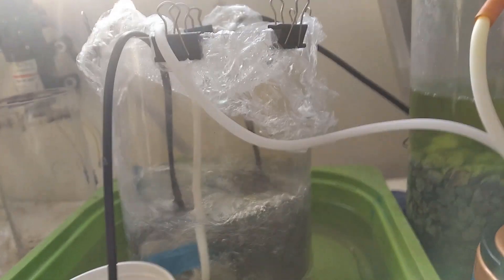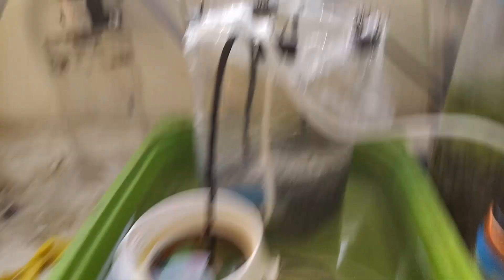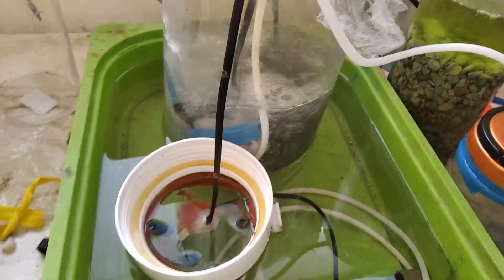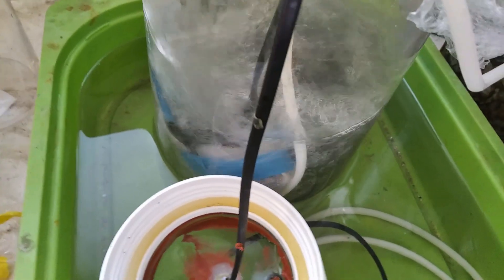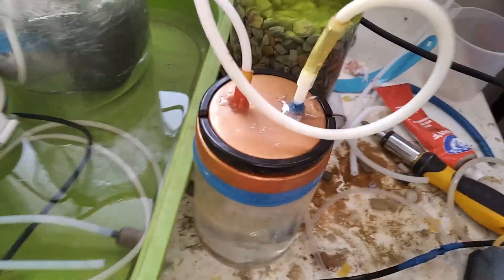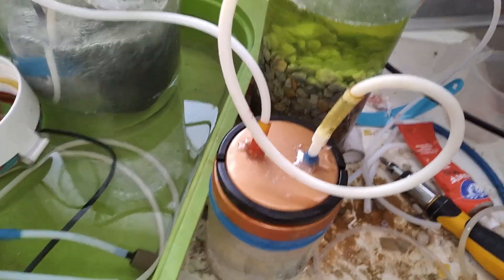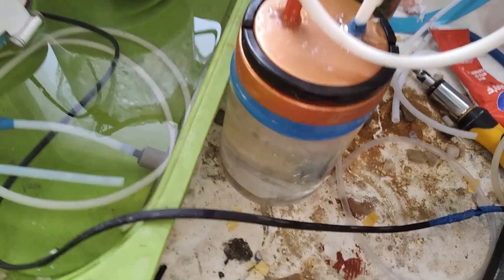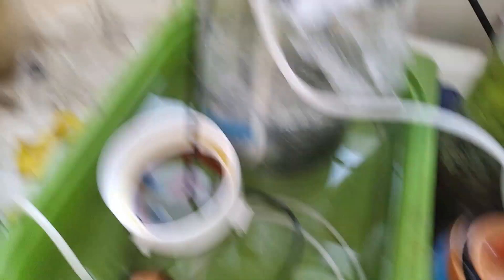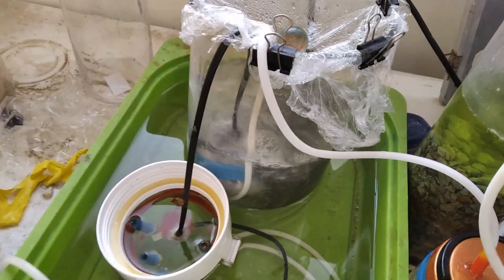I'm going to attach a second bubbler into the scrubber itself just to recover more. I want this to be as pure as possible, and I still want to get nitric acid — best of both worlds. The idea is that if you have an excess of nitric oxide (NO) and some NO2, you will produce very pure nitrite here. Over here is where everything else just gets washed.